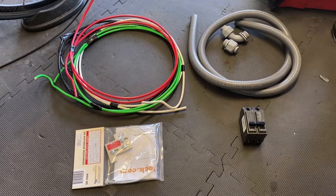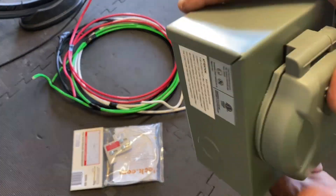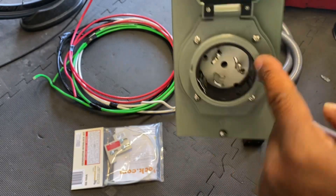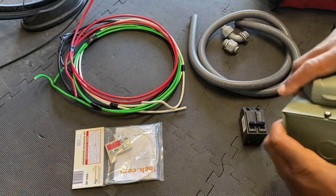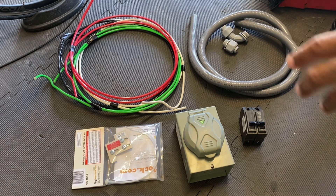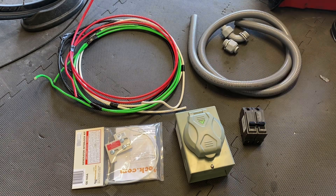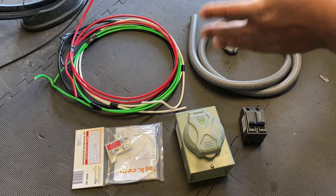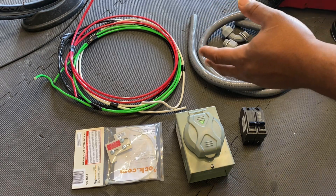It's just set up to mount against the exterior of your house, and then you run the generator cable right into it. But the way you hook it up to your house's electrical system is important. The way I'm doing it is with an interlock. This right here is my cable — it's a six-gauge wire with white, black, red, and green for all the different legs.